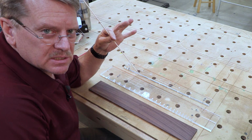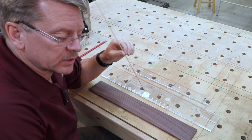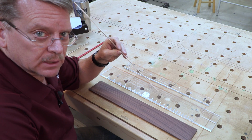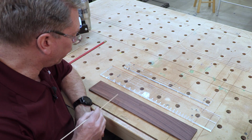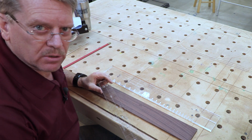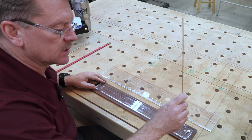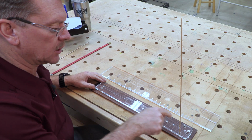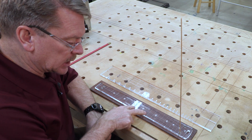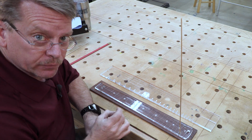I really wanted to create something that simplified the process of cutting the fretboard slots, the fretboard shape, and getting that to perfectly seat and match onto the neck blank itself. And so what I did is I combined two different things, two that would have been separate steps. Normally, I would take this fretboard and draw the center line all the way down it. I would take a template like this, generally after I cut my slots, and line that template directly on the center line, and then I would drill, in this case, 1/8 inch holes directly into 4 locations on the back of the fretboard, and that creates an alignment. That same alignment jig, if you were to call it that, or template, is then used on the neck blank, and therefore the two alignments mate with each other, and it is perfectly placed every single time.